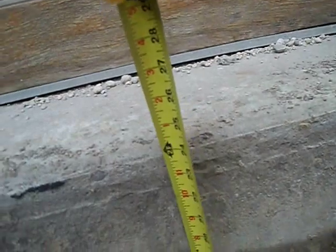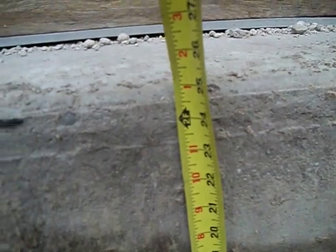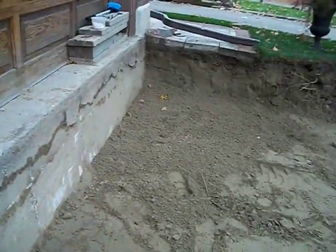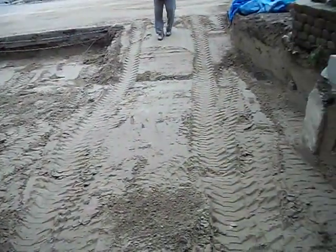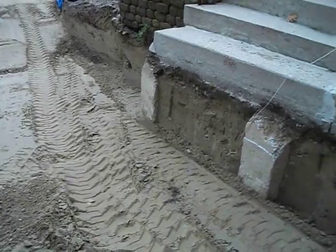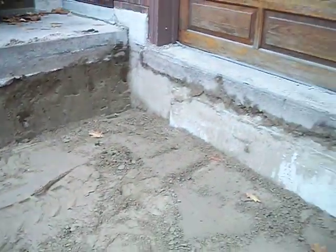As you can see there, at the top of the garage line, we've got pretty much on par — just a little bit over 24 inches — and that's going all the way across and all the way down. Everything is about 2 feet down from that. Now when we backfill it with Granular A, we're going to do it in about 3-inch lifts.